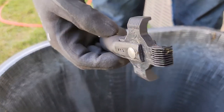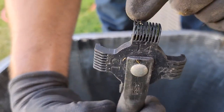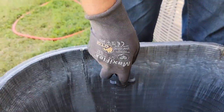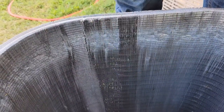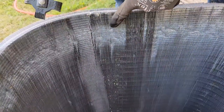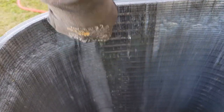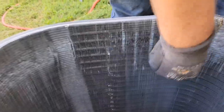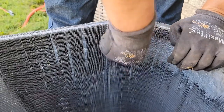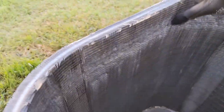We're going to do a little upside down with the fin straightener here. We've got it set to 14 still — that means 14 fins per inch in this spacing. See how bent and smashed it is? Come over here — now you can see in that little area how straight it is. Coming right beside it, it doesn't take long. You can straighten these fins out pretty quickly. Look at this area now — nice and straight. Now come over to this area, look how bent it is.